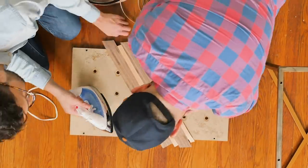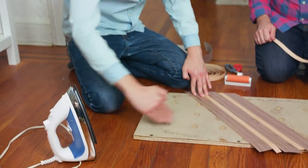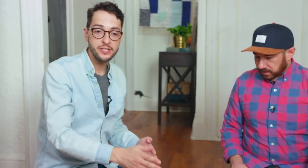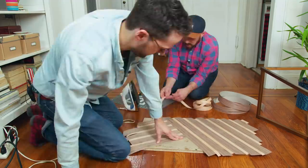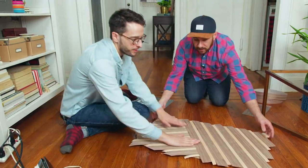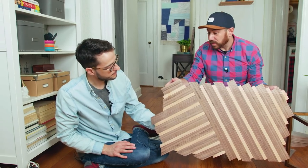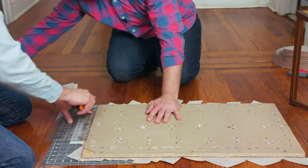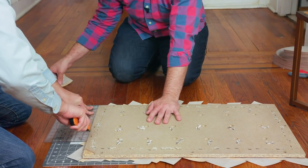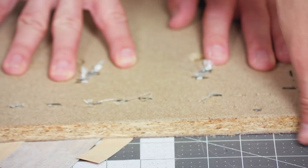This is just going to be our little coffee table, so it doesn't have to be too perfect. This is going really well. We're going to switch things up and bring the diagonals going this way. For that, we're going to need to get some really clean edges, so we're going to cut them with a razor just so we have really clean lines. It's all done — it looks really good, so we just have to trim it up. We're going to use a razor blade to cut off the excess veneer strips, and then we're going to do the sides. I just have a nice flat surface to hold against the board to make sure it's nice and straight. We have all our edges cut.